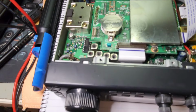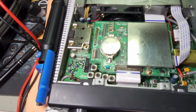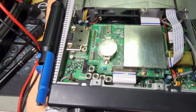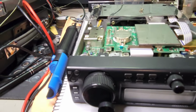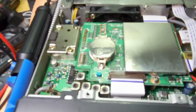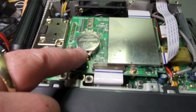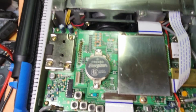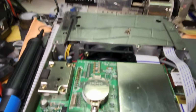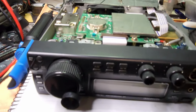And that's your job. I'll just finish off the video. We've got to go back and power it on and off. I do it around about 6 times. If you don't, these actually don't last very long at all. The current draw is around 1 milliamp. Without doing the cycling, it goes to 0.